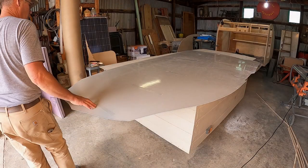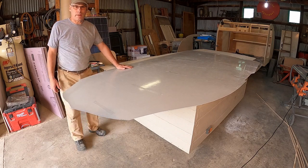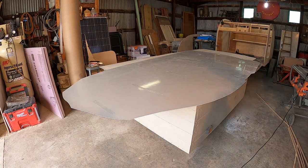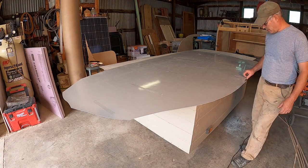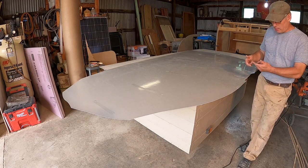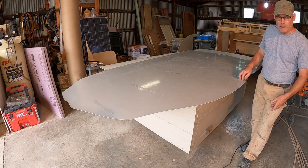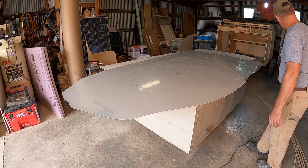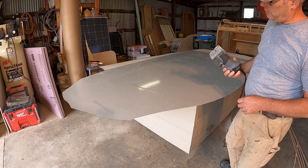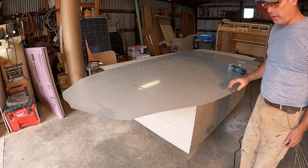All right, I've started to trim my edges, and I guess it's working out. I was using the regular router bit that I used to cut the half-inch plywood. That was a little tricky because of finding the balance between how deep to set the wheel against the 1/4-inch plywood and the cutting edge. But I got a whole piece done. Then I found I have a laminate bit, which I just tried, and that works really good. It's designed just for that sort of thing.